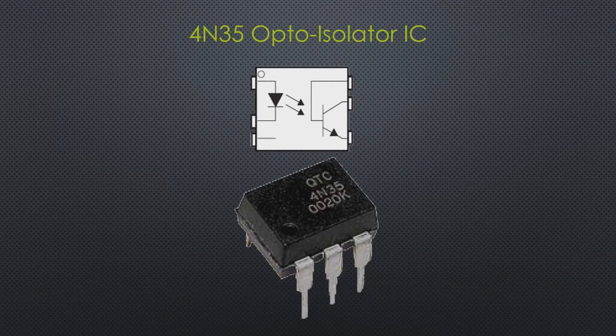Since we're using 24 volt pins to drive things, sometimes you might want to turn on a device that's 5 volts or 9 volts or something different, so we need a way of interfacing between the two. Also, if you hook it up to something wrong, using an opto-isolator means the worst case is you'll blow a 20-cent chip versus your $200 MESA card. I get these 4N35s in packs of 25 and use them like crazy. Internally there's a little LED with an anode and a cathode. When we supply current to it, it lights up and shines on a phototransistor on the other side, which then conducts and drives our load. It has a collector, an emitter, and a base pin — but we'll never use the base since we're driving it with light internally, so that pin is left disconnected.